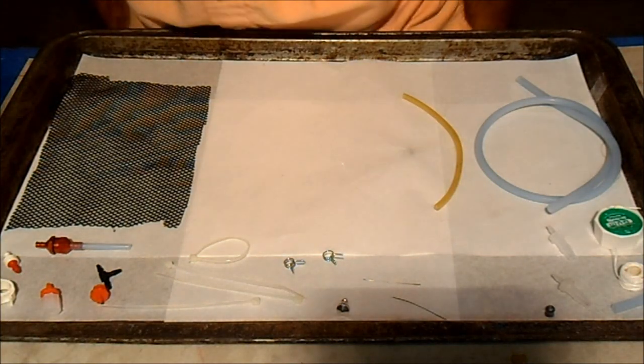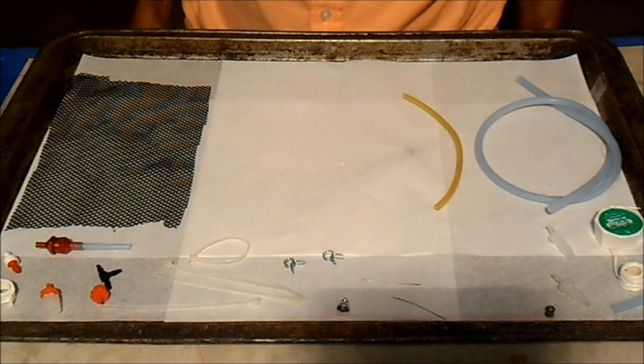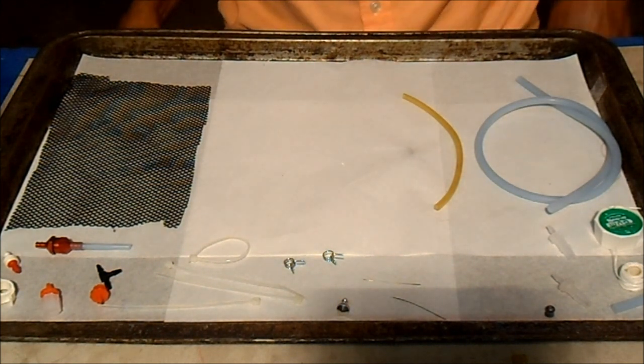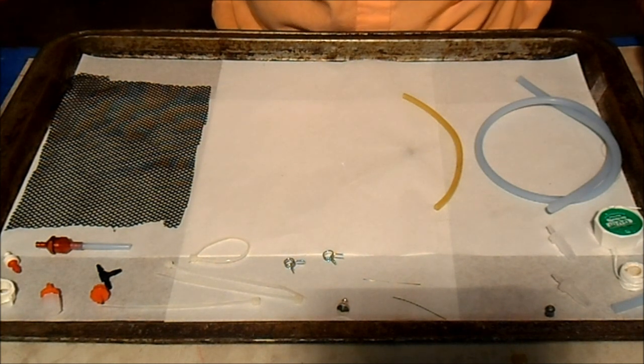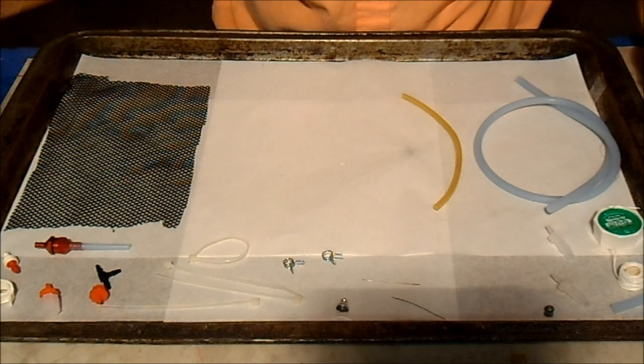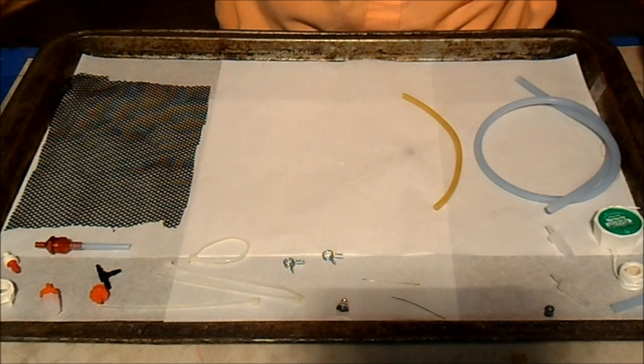I'm going to show you how I make a fuel bladder that I feed my Cox Tee Dee 049s with. Since they're aerobatic planes, you've got to have constant pressure whenever you're in any wild position in the air, and this works much better than hard tanks do.